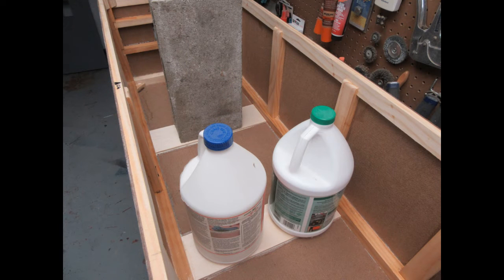As with the stiffener for the front panel of the case, two stiffeners are added for the bottom of the case. They are made from 1/4 inch craft plywood, and regular wood glue is used. The two stiffeners have been positioned where I expect to mount the two main foam pillow blocks that will support the instrument in a later step.